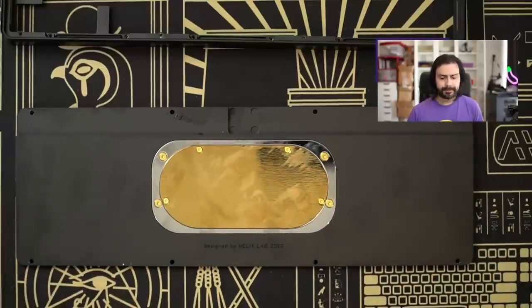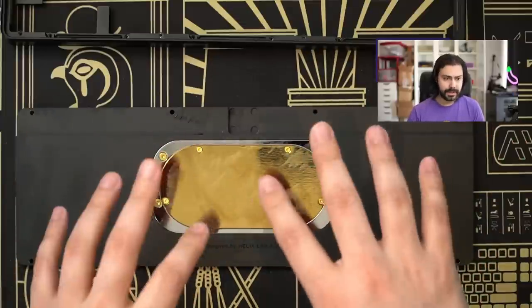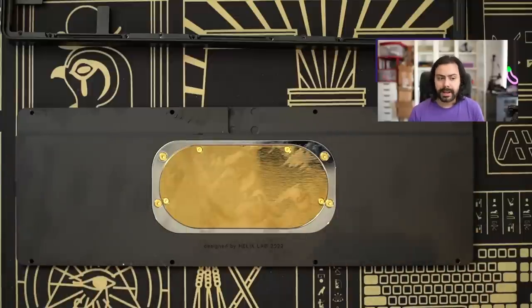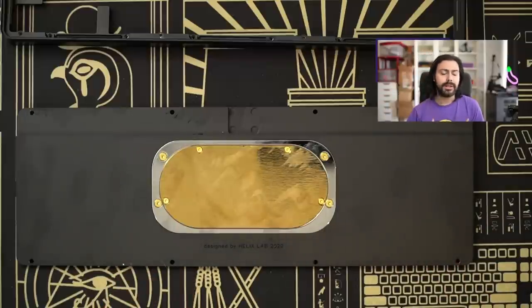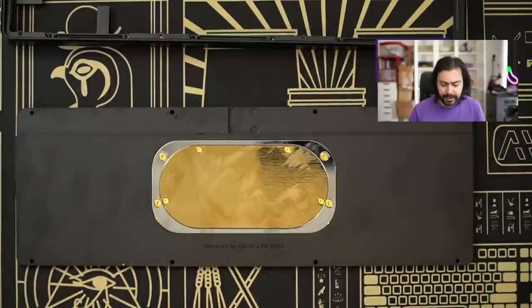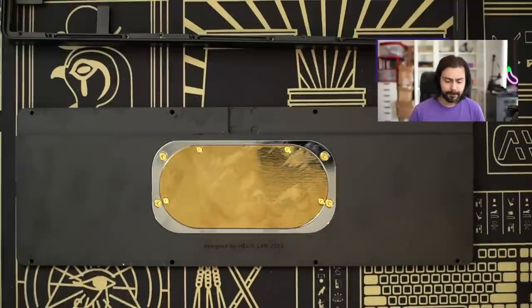The reasoning behind this is, when you're typing, you have the sound that will disperse through the case, and you've got the sound that will be emitted through the air from the plate PCB assembly. If it's going to hit a perfectly flat surface, it's going to come straight back at you like a mirror. Essentially, it'll sound echoey or pingy, reflecting whatever issues you have in your plate PCB assembly right back to you. Is that really noticeable here? A little bit. We'll cover that later once we get to sound, feel, and story time. But for now, just keep a mental note that the bottom piece is basically flat, which is kind of a no-no. If you look at nicer boards and the internal brass weights, they'll have a little bit of texture on them, they'll have something going on.